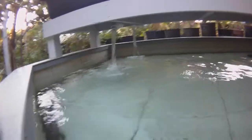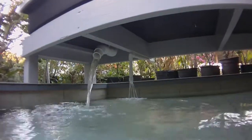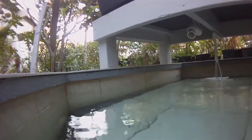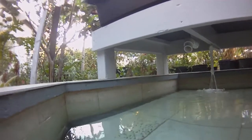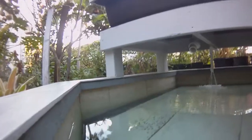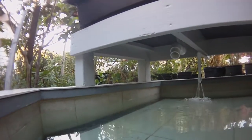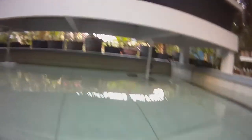Like I said, it's a bit hardcore. These are 2x6s, 4x4 posts. If you look at how we did it, we actually framed the whole thing — you can see it from underneath. The 4x4 posts are the ones that support the stuff. We actually did a 4x4 going straight across with a 2x4, making it into almost like a 2x6. We even put a plexiglass spacer just to make up for that missing quarter inch. We put Simpson ties on the inside.